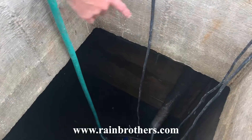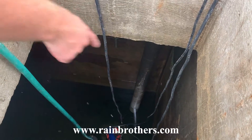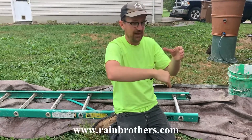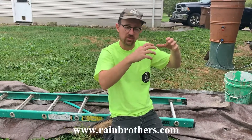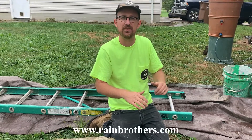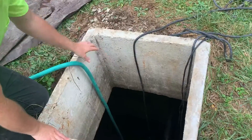However, this particular pipe goes all the way to the floor and needs either concrete blocks surrounding it, or the pipe needs to bend back up 180 degrees to create what's called a force breaker. That 180-degree bend prevents the water from just stirring up the bottom, allowing it to come in slowly and maintain those sediment zones — which is also called a calming inlet. In this case, we would notify the homeowner that they need concrete blocks surrounding that calming inlet pipe.